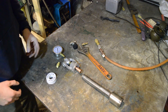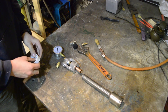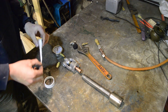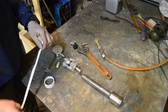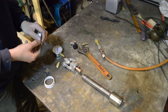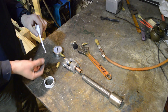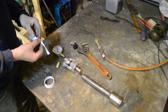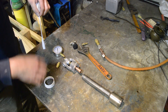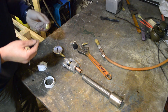These are obviously quite dangerous bits of equipment and you need to make sure that there are no leaks. So I'm going to use some PTFE tape. You could use something like a thread sealing paste or yeah, PTFE or thread sealant — it's entirely up to you. But the important thing is that you use some sort of protection on the threads.